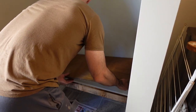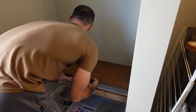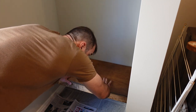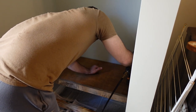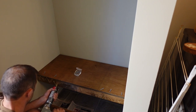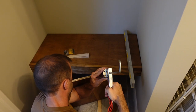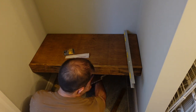After a quick dry fit with the plywood, I lay down some construction adhesive and set the top of the bench seat onto the boards, then screw in the front piece. I'm using a brad nailer — pretty much the smallest air nailer possible — to fix the bench seat down to the solid maple supports. For the board covering the front edge, I use construction adhesive, brad nails from the back, and a few one-inch screws from the back that don't penetrate all the way through. For the bench divider piece I use construction adhesive only — no brad nails.